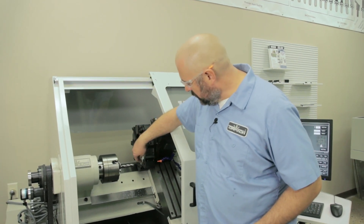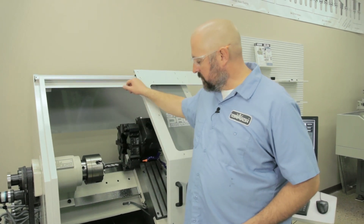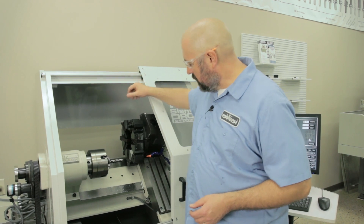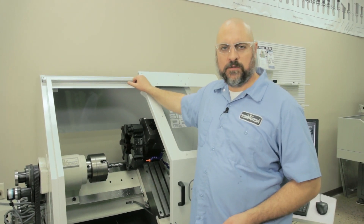So we're going to machine this one out with a three-quarter inch carbide end mill. We'll just peck through it using the jog shuttle, and then it'll be sized out for your Tormach tool holders.